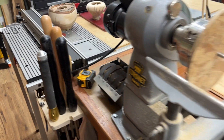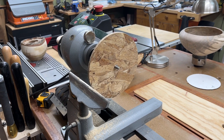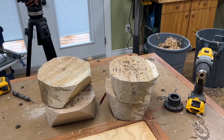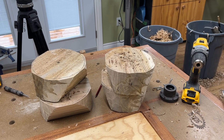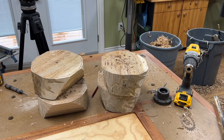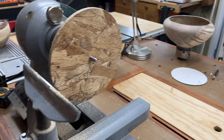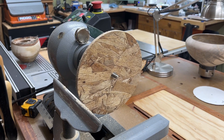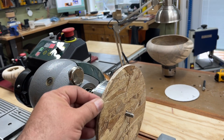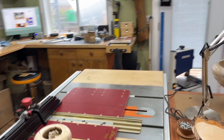Number three: this right here. If you're making solid bowls specifically and you want them all the same size — or in my case I'm making four that are supposed to be individual from the same log, and there's also a rough-turned big one, so that's a set — I want them all equal. Use a worm screw and make yourself a template for whatever size you want them to be. Put the template first, then put your blank, and turn — you don't go past that. That's your guide so they all come out the exact same size.